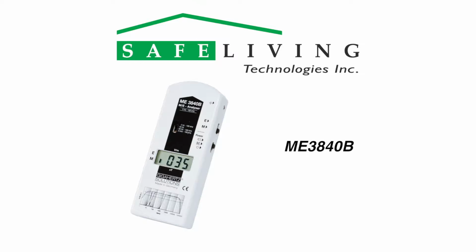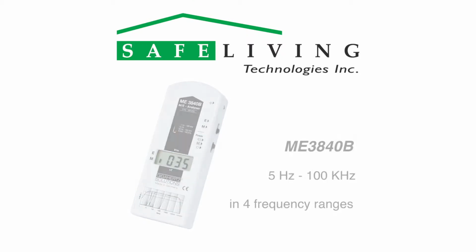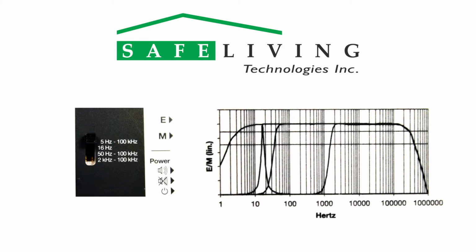The ME3840B measures frequencies between 5 Hz and 100,000 Hz, or 100 kilohertz, in 4 ranges. The first frequency range covers the entire band of the meter, which is useful for detecting all sources of EMF. In this range, the meter must be very stable. It is recommended to use a tripod when measuring in this range.